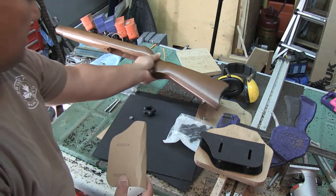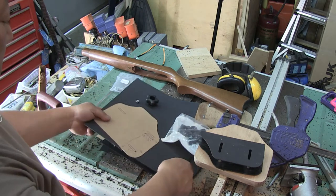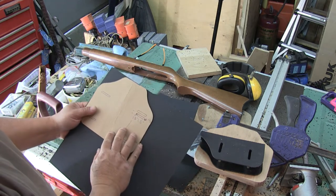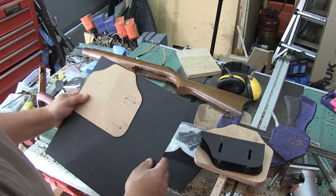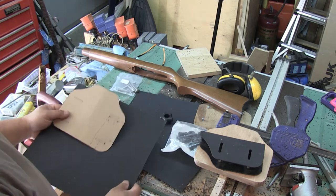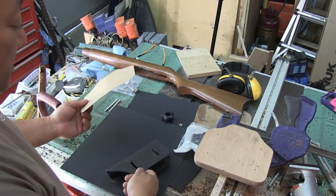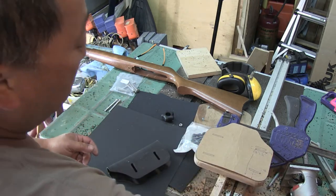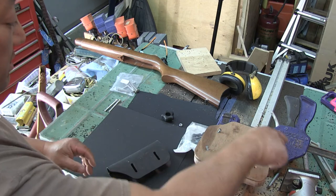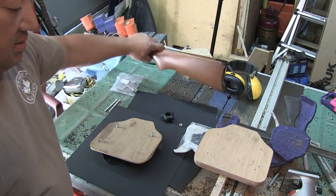That's as complicated as it gets. Once you've got the template, if you're just making a one-off it's fairly straightforward — get your kydex sheet, trace it out, cut it with tin snips or a saw, then sand it on a belt sander or by hand with a file. Because I'm making almost a dozen, I went to a more production-scale method: I created a template, and I've got a router with a bit and a tough surface that I'll screw onto it, then route out the shape.